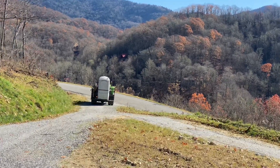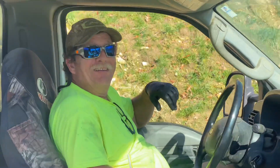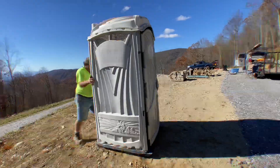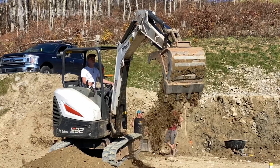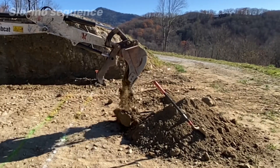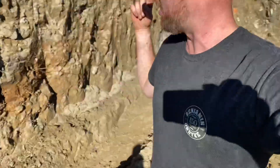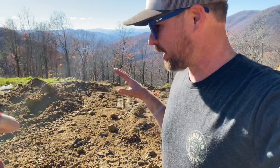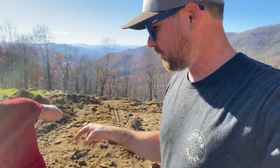Now we got a toilet. You actually need a toilet to get your first inspection — they won't pass you if you don't have one on your job. This footing is deeper on the front because there's no backfill on this side. On this side there's eight feet of backfill on top of the footing. The bottom of the footing has to be at least a foot below grade in this climate — much deeper in colder climates so that the ground below it doesn't freeze and push the house up. So we're going deeper here, about six inches deeper.